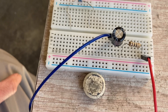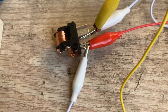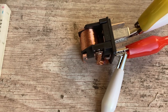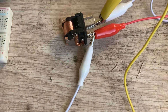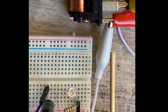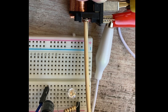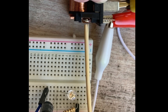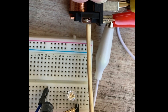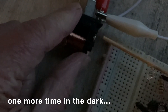For the first iteration I've got a 100-ohm resistor with a 10-microfarad capacitor connected across the contacts for the motor power, to see if that's enough to suppress the arcing. I'm going to take one more look with the diode in the suppression circuit, changing the angle to make sure we're getting good contact visibility. We're definitely seeing some current go through the diode and lighting up, but I'm not seeing nearly the amount of arcing we saw earlier. So it looks like it may be a viable solution. RC circuit attached — let's look at those contacts one more time.